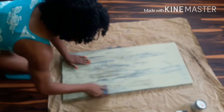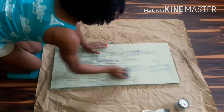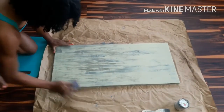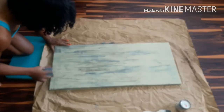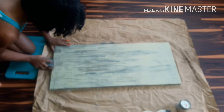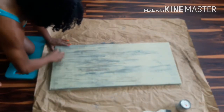You could probably also use a hand sander as well. Just make sure that you don't hold it in one spot for too long. Otherwise, you're going to take off way more paint and stain than you probably want. But don't just move in one direction. Go in all different types of directions, diagonal, and gouge out some spots to make it look real.